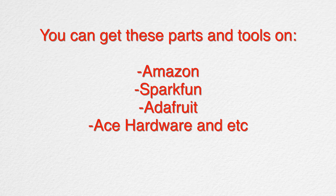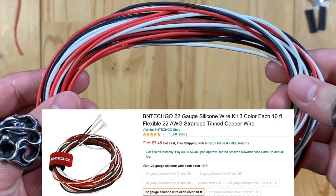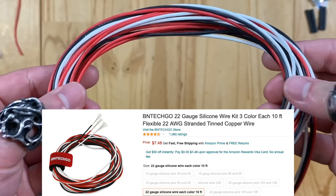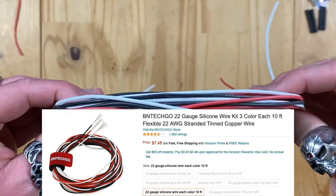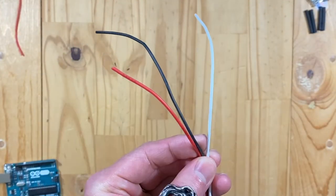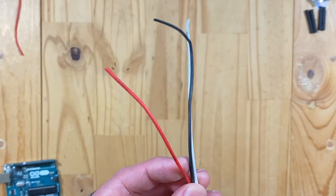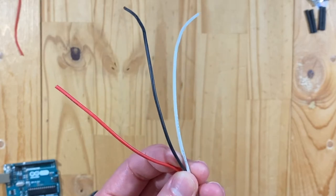Here's what we need, and I'll put the links below. You can get these at your local hardware store and sites like SparkFun and Adafruit, or Amazon. Some stuff like the crimps can be difficult to find, so you might just have to use Amazon. First, 22 AWG wire — AWG is the thickness of the wire. For small DIY projects, we use 22 AWG. Please purchase stranded wires because they are more flexible, and please purchase three different colors so that you can distinguish between power, ground, and data, which we'll learn about in the next video.